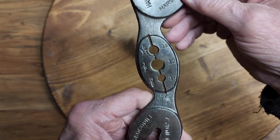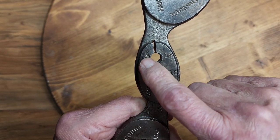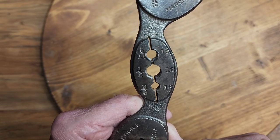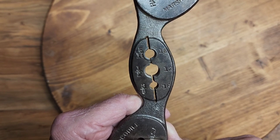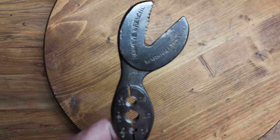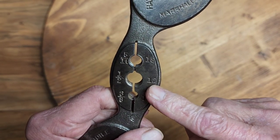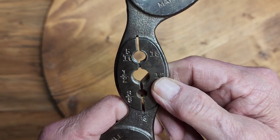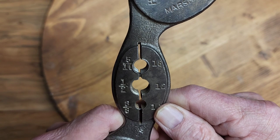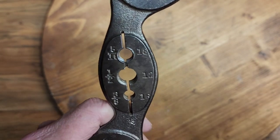The labeling on this is really interesting. If you look closely, it says this is 3/8ths by 16 thread, 5/16ths by 18, and 1/2 by 12. Well, first of all, the most obvious thing is there is no 1/2 by 12 thread — standard threading is 1/2 by 13. The comment was made to me that perhaps this was done before the standard was changed. But why would one be the old standard and these two be new? Actually, 1/2 by 12 wasn't a U.S. standard — it was a British Whitworth standard. These other two are up-to-date standard U.S. sizes, 5/16ths and 3/8ths. I don't know how it got labeled that way, but let's go ahead and look at the rest of it.